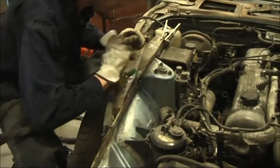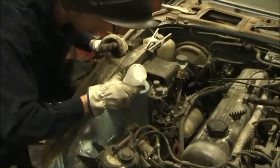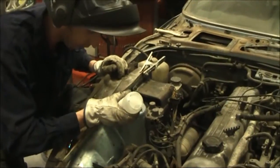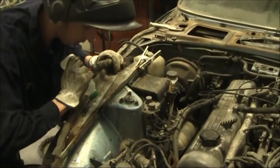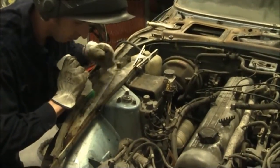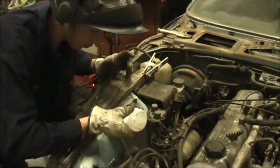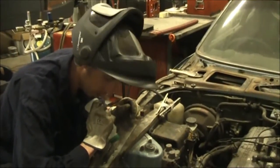While this is still hot, we're going to get our squirty bottle and quench the stud — be fairly liberal with the water. At this point I'm not using any penetrating fluid. Penetrating fluid will actually evaporate before it gets to the stud. Water has a better effect by capillary action, wicking its way through in between the two surfaces, and it also acts as a type of lubricant. Don't be shy with the water — it can all be cleaned up later.